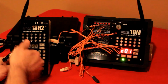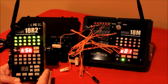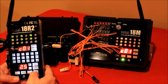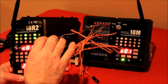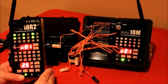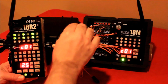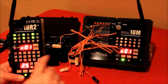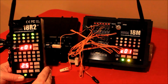I'm going to turn the remote back on, and I'm just going to demonstrate and show you the difference between firing with the Ematch, which you already saw, and then consumer igniter. And this is going to show you basically the amount of current or sustained current when you go to consumer igniter mode, because we all know sometimes it takes longer for consumer igniters to fire, so when you put in that mode, it gives a sustained current to that for approximately 2 seconds.